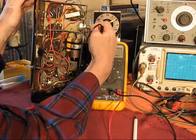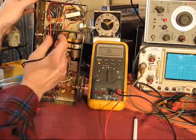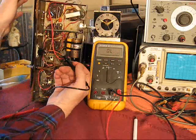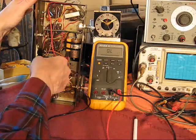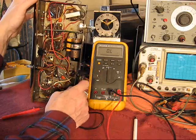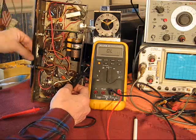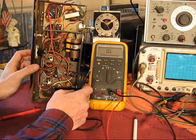So this volume is actually two volume controls in one. In the center, it's all the way down. To one extreme, it's phono input all the way turned up. And in the other extreme, it's radio turned all the way up. It's kind of cool. So once I get this thing buttoned up, it's back in the cabinet, and it's already been peaked. I'm not going to mess with that anymore. I did do a full realignment of this thing, and it's quite a hot radio. It works very, very well. I'm rather surprised to hear, with no external antenna, just this powdered iron or ferrite rod loopstick in here, what this thing's able to get, especially at night.